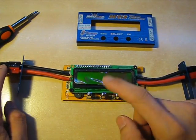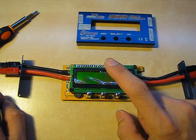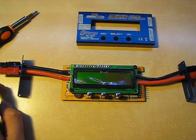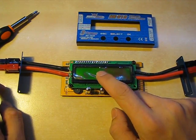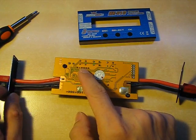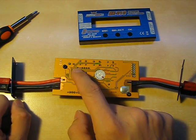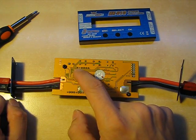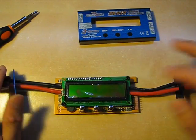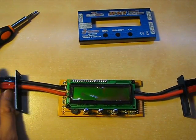Going inside: this is a microcontroller-driven device, run by an ATmega16U with 16K of program memory. There's plenty of space for any code that runs here and loads more. Interestingly, the in-circuit system programming port is exposed — unpopulated, but it's here, six pins — free for anyone to muck around with. The manufacturer potentially hasn't turned on the code protection bits, so people could dump the firmware and modify it, or just install their own. It's free for the hacking.